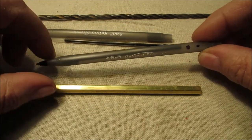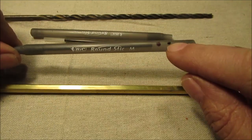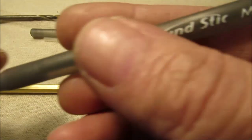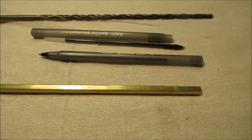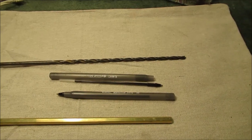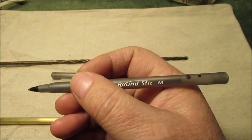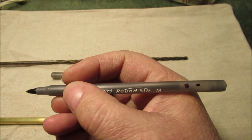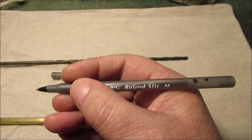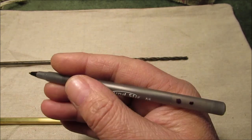We're at the limit on our lathe with 5 inches, so we've got this marked at the second mark, which is 4 1/2. That's 4 1/4. Let's get you up here a little further, now that we got you up close to see what the parts were, the components. We'll put this in my hand and show you. I can live with that for an ink pen. 4 1/2, so that's what we're going for. 4 1/4 is almost too short. About 4 1/2. See where the pen lays in hand?